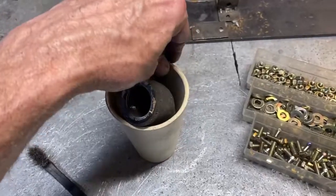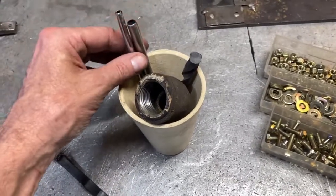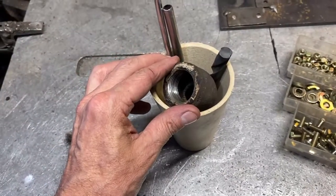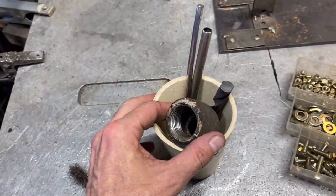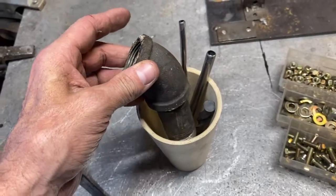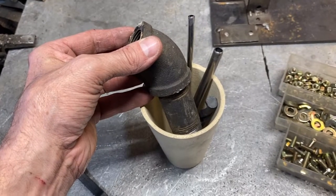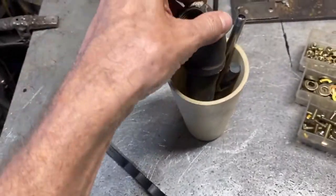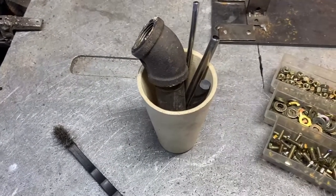The charge consists of one piece of high speed steel, which has a melting point of 1,430 Celsius. We've got some stainless steel here which is 1,450 Celsius — sometimes labeled as 2,750 degrees Fahrenheit, though possibly 2,650 as well. This top piece is cast iron coming in at 2,200 degrees Fahrenheit melting point, which is 1,204 Celsius. And this bottom piece is wrought iron, which has a very high melting point of 2,900 degrees Fahrenheit or 1,593 Celsius.